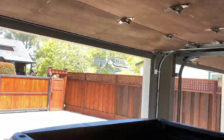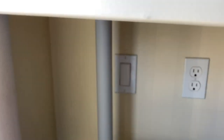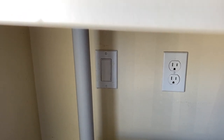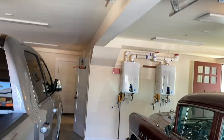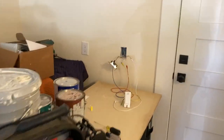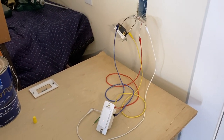Here's the lay of the land in Jordy's very nice three-car garage. The ceiling lights can be controlled from three positions. Over here by the door is the line side box — this is where power is fed into the system. Power goes up across the ceiling all the way to the other side, then behind this storage box there's a four-way switch sitting between the two travelers — that's the second position. Finally, in the back, is the last three-way switch — the load side — before power goes up to the lights.